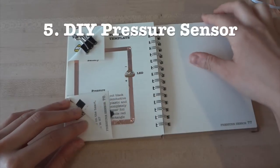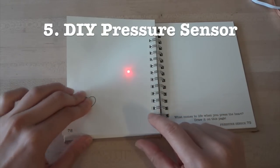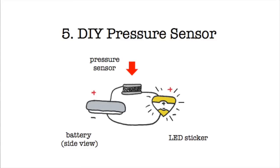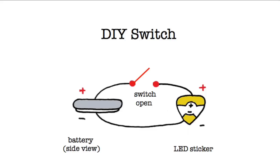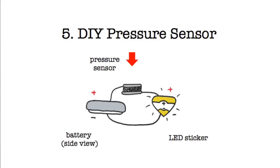Hi! In this tutorial, we'll show you how to make your own pressure sensor. This lets you fade a light on and off depending on how hard you press. A pressure sensor lets you control the brightness of your light — it's a bit like a switch, except instead of only turning your light fully on and fully off, it lets you gradually fade the light in and out. In a switch, we bridge the gap in your circuit with metal foil, which fully connects or disconnects your light from the battery, causing it to turn either on or off. In a pressure sensor, instead we bridge the gap with a special plastic sheet with conductive particles in it. The resistance of this sheet, or how well it conducts electricity, changes when you press on it.